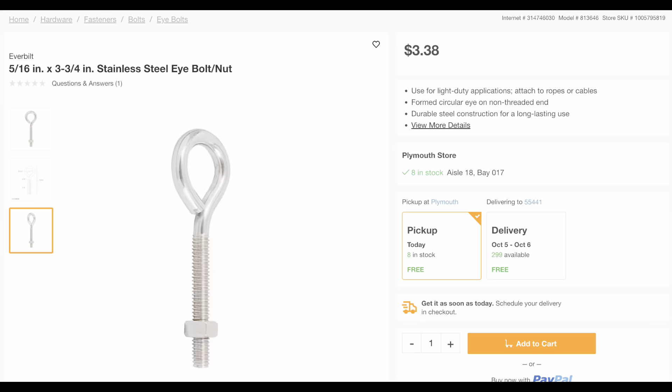You're also going to need some stainless steel eye bolts, which will go on the top of the poles to fasten your string lights to. Notice that all of the hardware I'm using here is five-sixteenths inch. That's what I'm using for everything to make it easier — you only need to buy one five-sixteenths inch metal drill bit so you don't have to coordinate different sizes. I just use five-sixteenths for all of it.